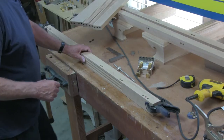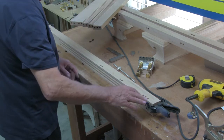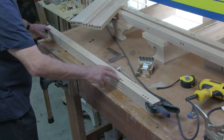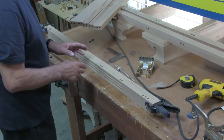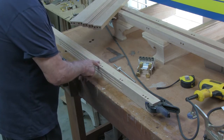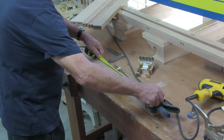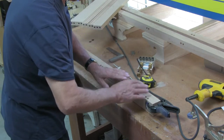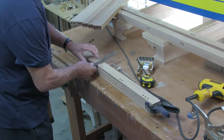Now, there are several ways to do this — this is my favourite. These are the two intermediate rails for the drawers. One drawer will be here, one drawer will be there. I've calculated that the distance to the top of the second intermediate rail is 18 and 5 eighths from the bottom. What you must do here is get them clamped so they're absolutely square and flush at the top and bottom.